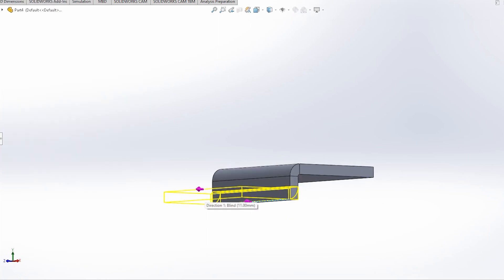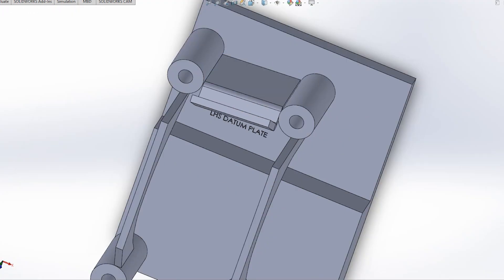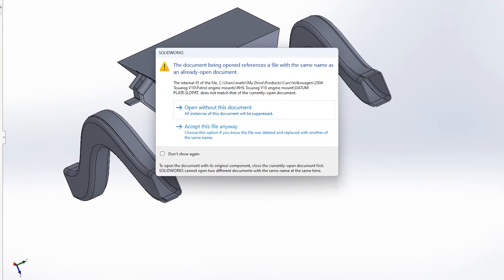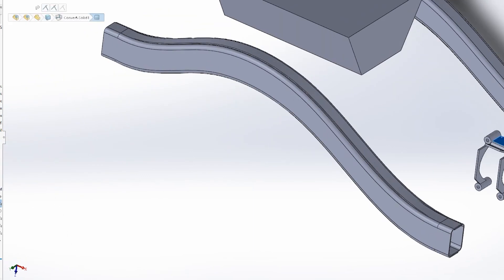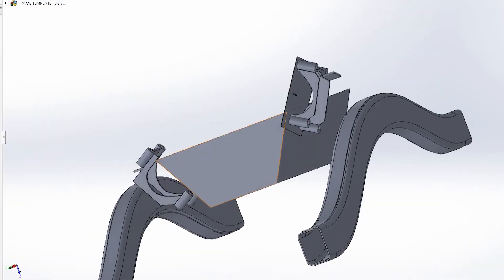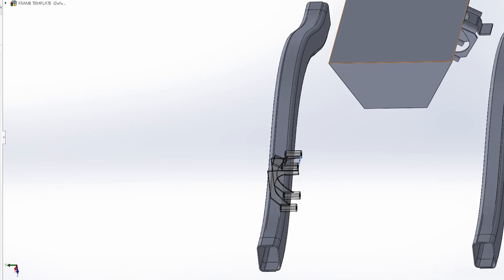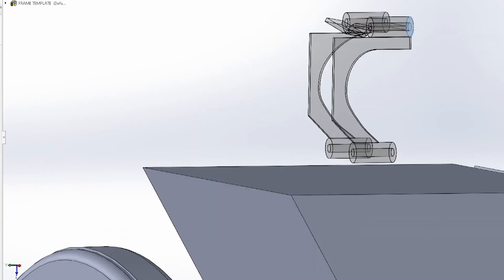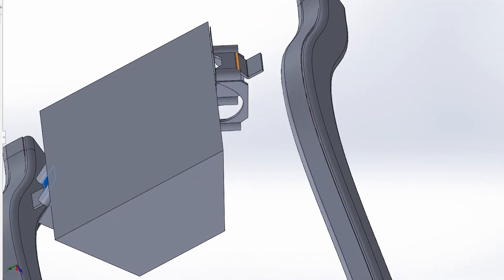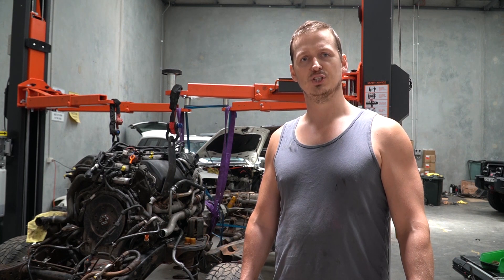Once everything's designed, you can do something called FEA — finite element analysis. The software splits your component into a million little pieces and calculates each element depending on the forces applied, then calculates how that element acts on its neighbor. This allows you to find where the maximum and minimum forces are. In my case I'm using 5mm mild steel, and you compare this to the strength and modulus of your material to figure out if it's strong enough. If it isn't, you change your design, change your material, or scrap the idea. Finally, you apply your safety factor: multiply the maximum force by the safety factor, and as long as that result is less than the maximum strength of the material, you're good to go — in theory.